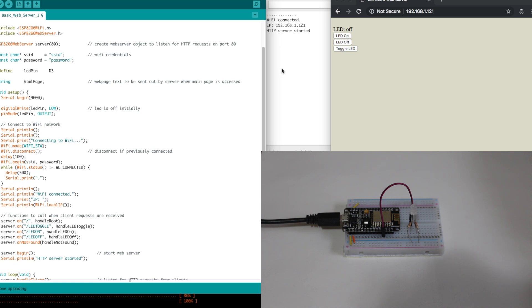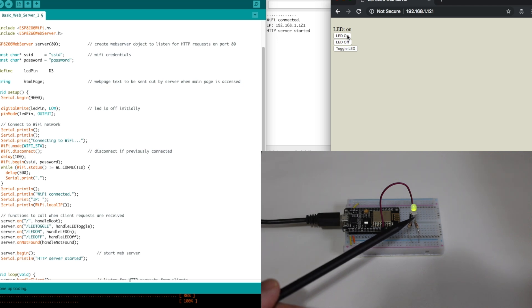With just the LED, I have the serial monitor running, and all it really does is show me that I'm connected and what the IP is, so I don't even need it after I've booted. The web page is right here. I have the NodeMCU ESP8266 connected to USB so I can get debug messages and power. It's running a Wi-Fi server and controlling one LED.